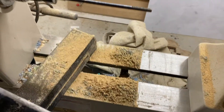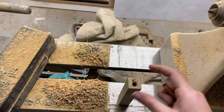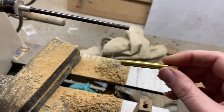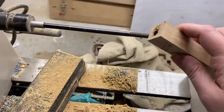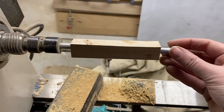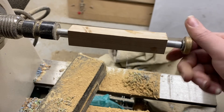Here is my bench, which is a mess because I've been turning pens all day. Here is the blank — this is the end that has the permanent tube in it, and this end does not. So in this end we're going to put another pen tube. This pen tube is slick — it has not been roughed up at all, and that's going to be important later. For it to turn nicely on the lathe it's better to put the pen tube in it. I always put mine with the loose pen tube towards that end of the mandrel, and then a second bushing, a washer, and the screw nut to hold it down tight.